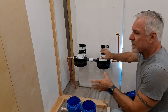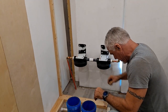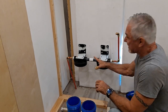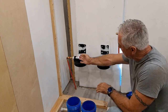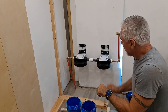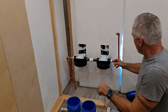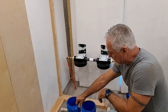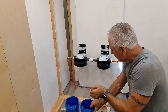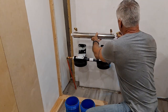So I decided to bring the filters in here and mount them between the shower wall and this wall. I've already put them in place. I had to shorten the pipe — it was about six inches longer. I still have to glue it all up. PEX is amazing — I really like it. As you can see, that one bends out a little bit, but there's no problem with that. I'll seal that hole really well on both sides and I'm not worried about it chafing since it's just wood and no metal. It comes up and goes through both of these filters — a five-micron filter, then the five-micron charcoal filter. From there it comes up to the UV light, which I'm going to mount next.